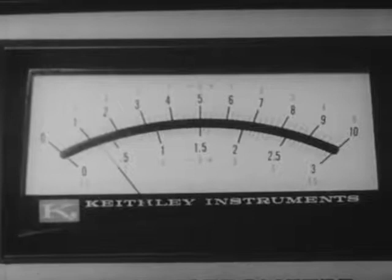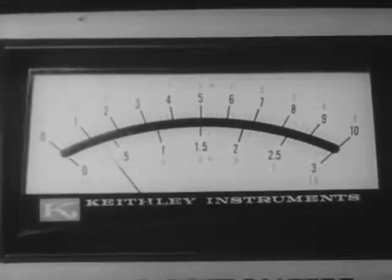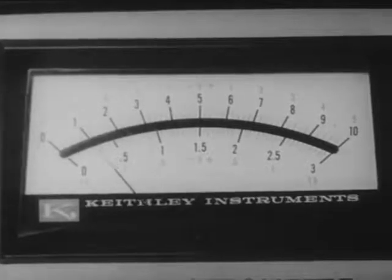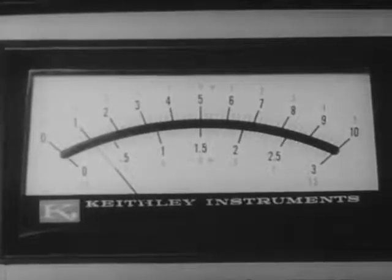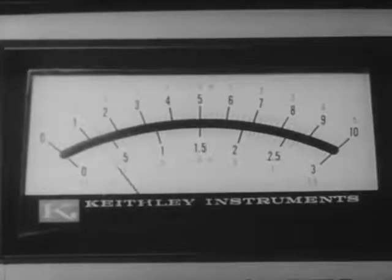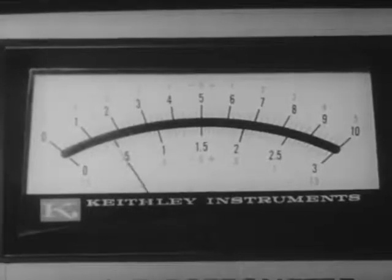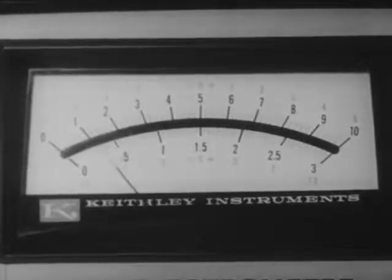This fluctuation, which isn't noticeable in larger currents, illustrates a basic fact about all electric currents. The elementary charges that make up a current don't go through the circuit with perfect regularity. In this case, there are sometimes more than 60 per second, sometimes less. The exact moment at which any charge goes by is just a question of probability. Let's see if we can make this more evident in several other ways.